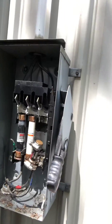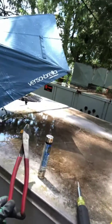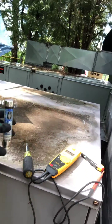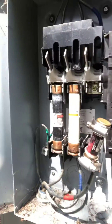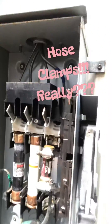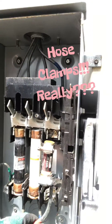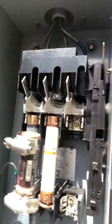I do know this is dead — I have it locked out and tagged out. After I cut off the zip ties, I put in another fuse from my van. It is a 60-amp one, which is correct. The previous fuse was zip-tied — it doesn't even fit in the contacts to hold the fuse holder properly.